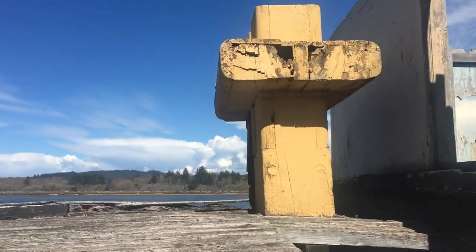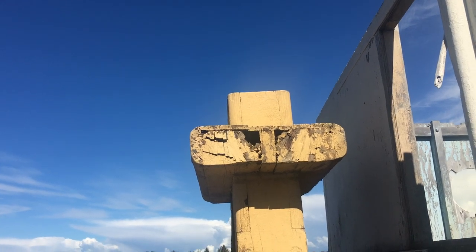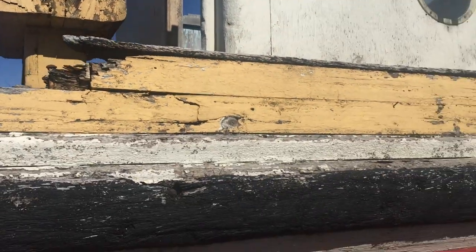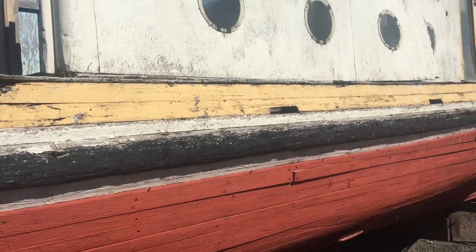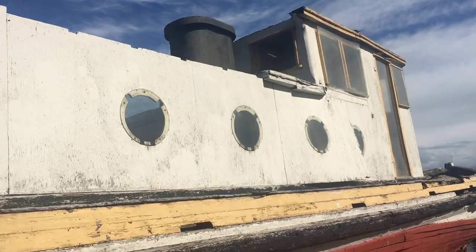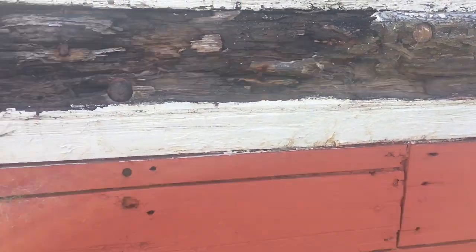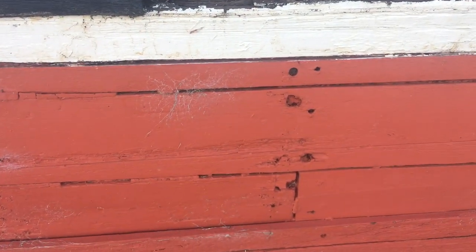Even those bits look like they've been worked over a few times. Not sure how much of that is cosmetic and how much is functional — I'd say functional, because none of this looks like it's been particularly cosmetically preserved. And this really crap-looking plywood deckhouse has been added to it. Here's a plank that's been replaced — you can see the butt joint here, and this is bad: one plank over, one down, another butt joint.